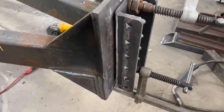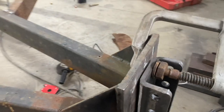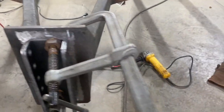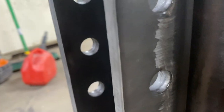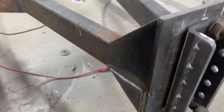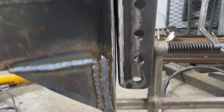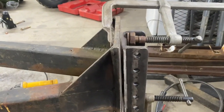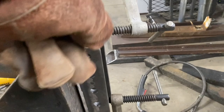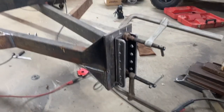Guys, I got my part mocked up here. There's a little bit of a gap — evidently this plate still has a slight warp to it, not bad, but I'm going to have to do a little more filling in there with that gap. I got the welder turned up and the wire feed turned up — that's as close as I can get it. You can see the slight warp to the plate but once we get it on there, this is what's going to matter when we're done. I'm going to weld it up now — it's going to take several passes.